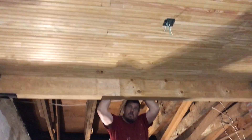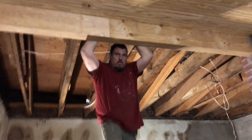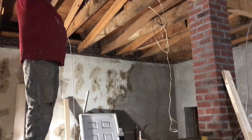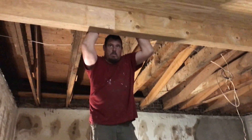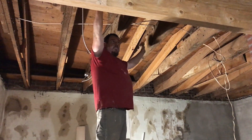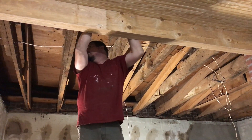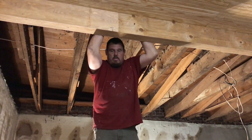They probably watched that video. This back room looked pretty rough before. The ceiling was pretty screwed up. Remember that beam over there? Everybody said don't touch the 4x4. There were posts over there and 2x4s up on the ceiling holding it up, because there was originally no beam in the middle of the building holding the rafters. That rafter goes from there to here and stops - it only went halfway, but there was no center wall to hold them up.